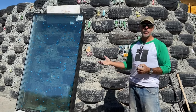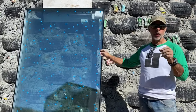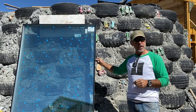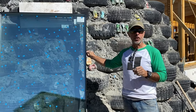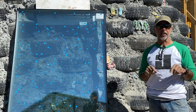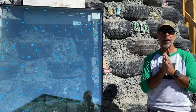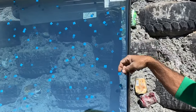So the glass, when it comes, you've got a couple of options. You could do certain thicknesses of each piece of glass on both sides, and the width of the spacer. The spacer is very important. This actually has a cavity inside of it, and it's got corner keys. And the idea is before these two pieces of glass are glued together, this spacer allows for a desiccant to be filled inside of it.